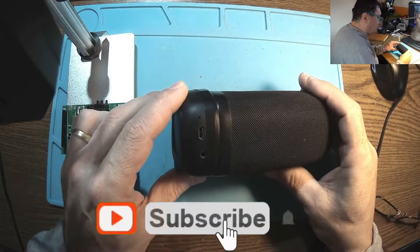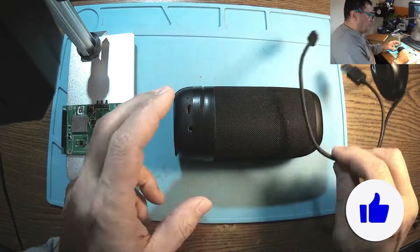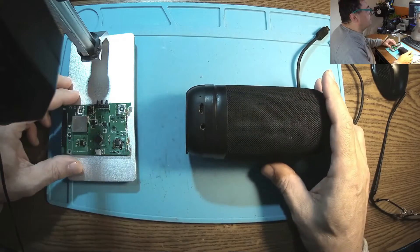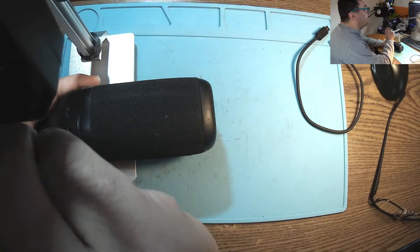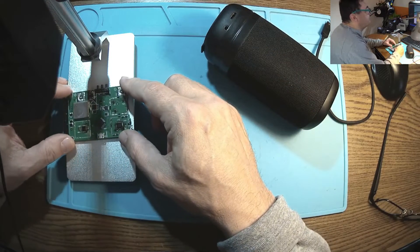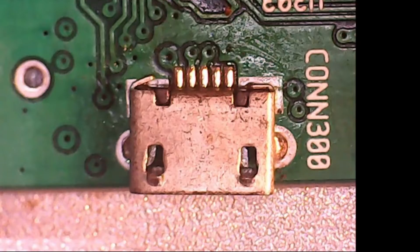For now I can see the USB port — it's smashed, that's for sure. He told me the cable was smashed and all the other stuff. Anyway, it's a micro USB connector. Let's see under the microscope — it's better to understand exactly what's happening. Oh yeah, this is not smashed, this is destroyed. Look at this port — I can't fix this as-is. The only way is to replace it with another port, and I have a donor board here.